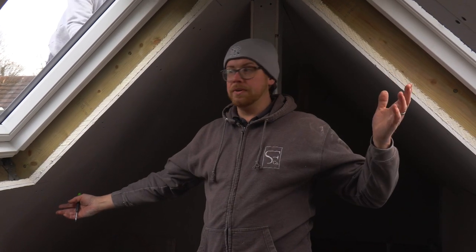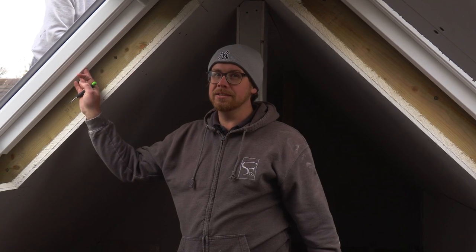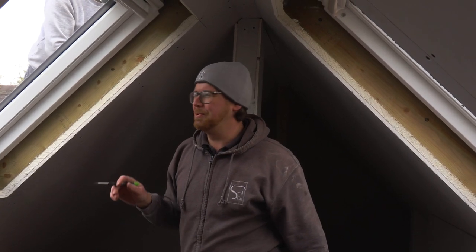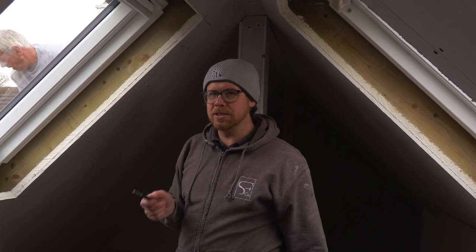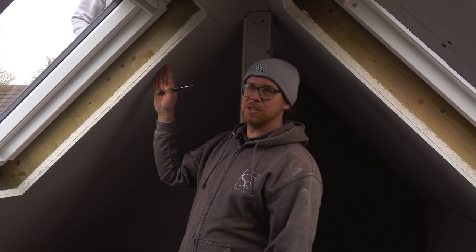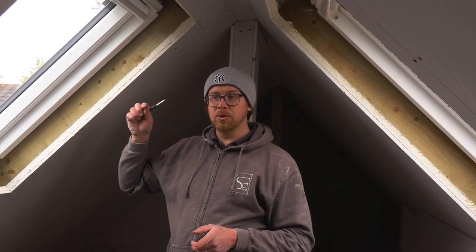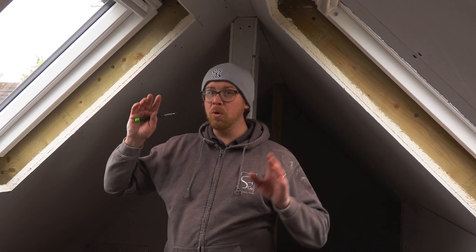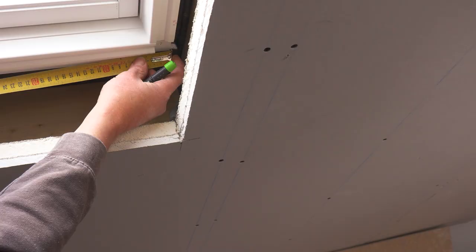Over something the size of a roof that's not a lot at all, but when we're plasterboarding up against a nice machine-made square window it's significant — we're talking joinery standards now for plasterboard. Out of those four numbers we need to choose the smallest, which is 18. If we went for 25, cutting back that far would go past the rafter. Before going any further, I'm going to check all the other three windows to make sure there's nothing smaller than 18 — because all four windows are right next to each other and they've got to look exactly the same. If the smallest point on another window is 16mm, these all have to be 16.